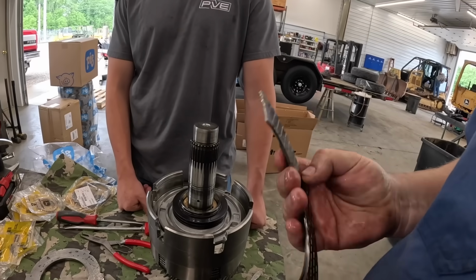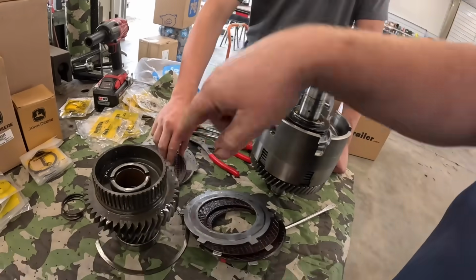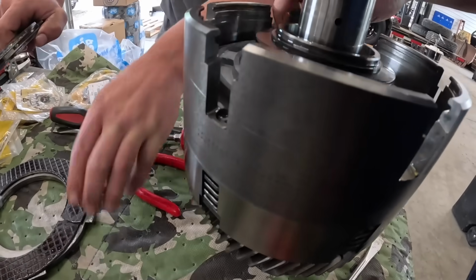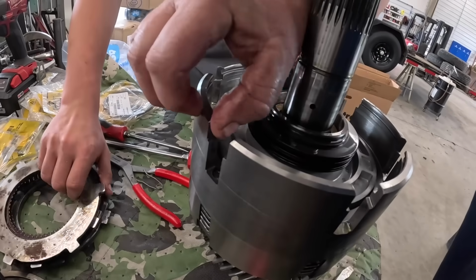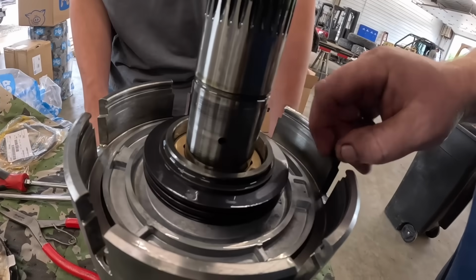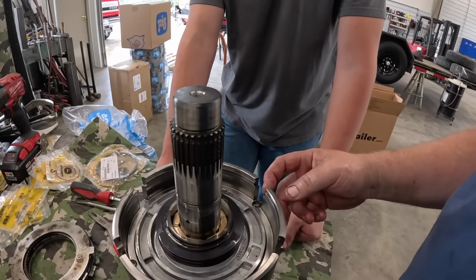That's weird, why that snapped. That's why that snap ring was spinning around in circles in there. It had too much pressure on it. So we'll have to inspect this clutch basket really well. That's why that didn't want to lift out of there too well. There's a little bit of burrs where that snap ring's been spinning in there. Or you just file it down or something? Yeah, we'll get it all apart.